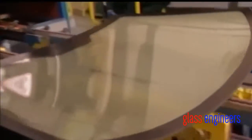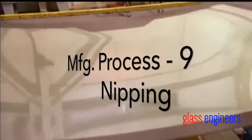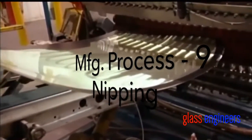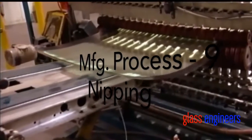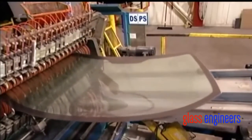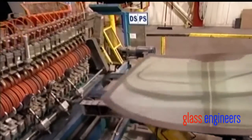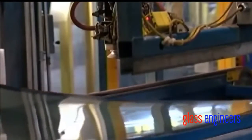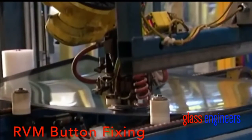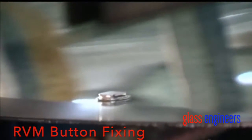At this point, there's no clear view through that milky-white vinyl. That's why the windshield is headed to a machine called a nipper. The nipper presses the windshield between a series of rubber rollers, squeezing out air pockets. As the air is removed, the view through the vinyl gets a bit clearer. Squaring pucks then position the windshield, and a robot sticks brackets for the rear-view mirror onto it.